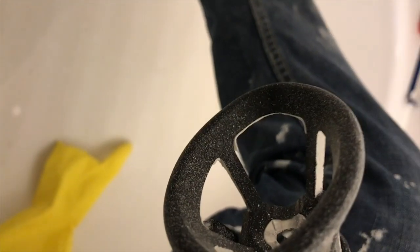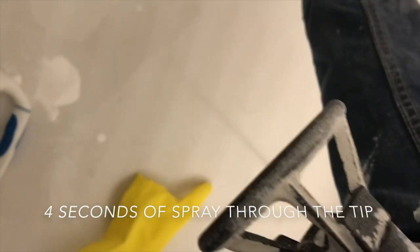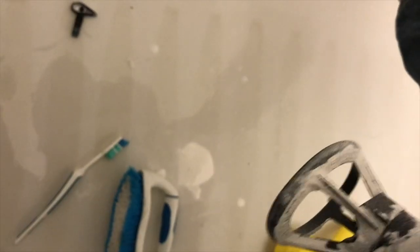Next, prime up a little more water and move it into spray mode. I've got the tip in drain mode. Never want to be looking into that tip — think of it like the barrel of a gun, because sometimes it'll release pressure if there's a blockage and nail you right in the eye. Now we're just going to spray out the tip for about four seconds. Then take the tip out, keep it in spray mode, and spray basically until it's clear — since the spray tip isn't in there, you're not damaging too much. Pretty much just dumping out water.